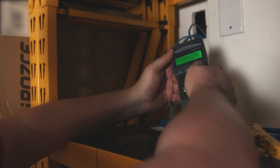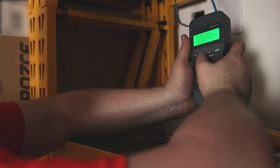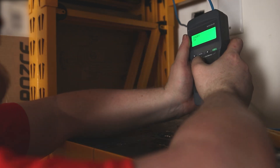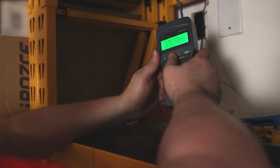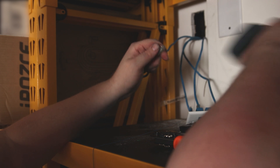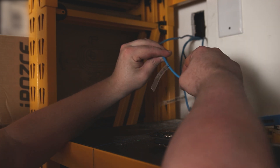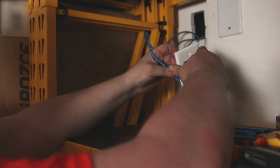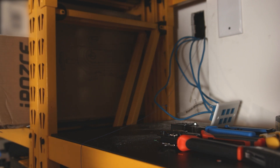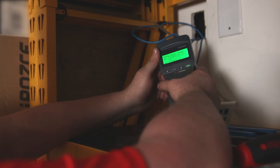Pass — awesome. The important room is wired. I'm plugging these in so they don't fall into the hole. Short on three and four — so I probably have to go look at the keystone on the east bedroom. Master bedroom is good. Let's go check what's going on with that east bedroom — replace the keystone, test again — pass, awesome.